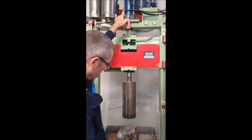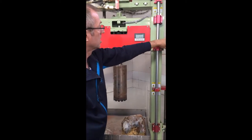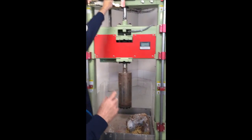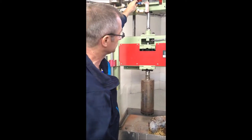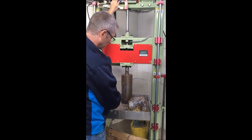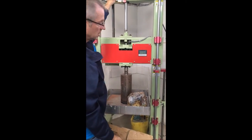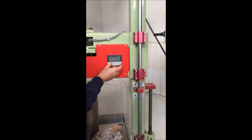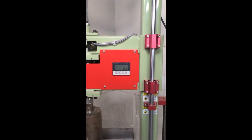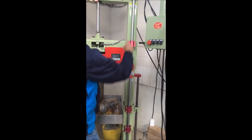Let me show you one other feature, which is a depth setting. The depth setting lets you set the end of the bit on the table and zero it out. That way, when you're in the middle of the rock, you know where you are in respect to the table, so you don't drill through the bottom of your table. To set zero, you press the clear set button and the enter button — those two buttons are the only things you'll use. You can change the units from inch to mm or vice versa, but it doesn't really matter because you're moving down through the stone and it tells you when you're getting close.